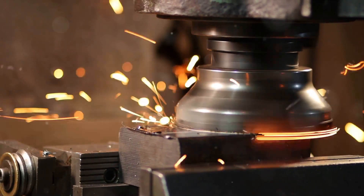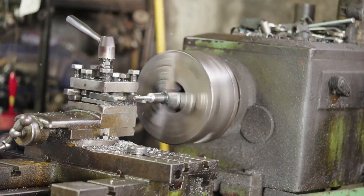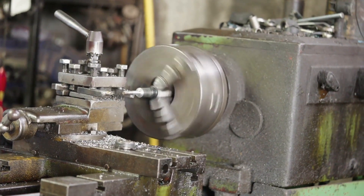For tooling, sharp cutting tools are your best bet to reduce sticking. High-speed steel or carbide tip tools are often recommended. Brass can be machined at higher speeds than many metals, so opt for higher speeds and moderate feeds to get the best results.